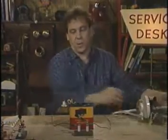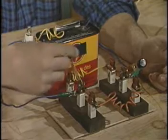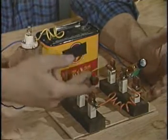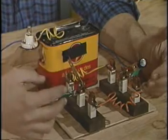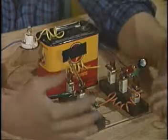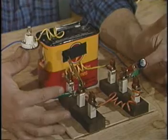Here's a model of the corridor switch, also known as the three-way switch. The set of switches has the same task as the other knife switch — just to interrupt or not interrupt the circuit. Each switch has three terminals: one terminal can connect to either of the other two depending on which way the switch is thrown. So let's call them 'common' and 'ends.' The ends are connected to each other by a pair of wires called the traveling wires, and the two common terminals become the interruption point for the circuit.